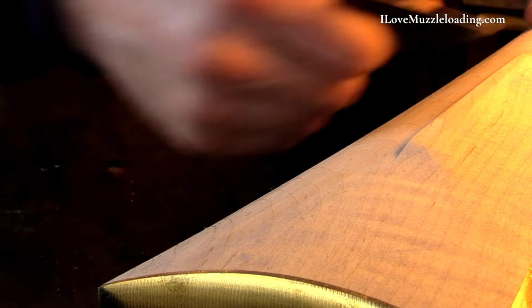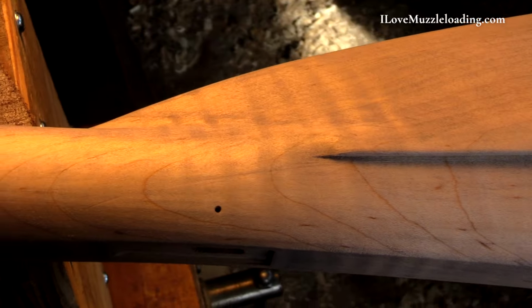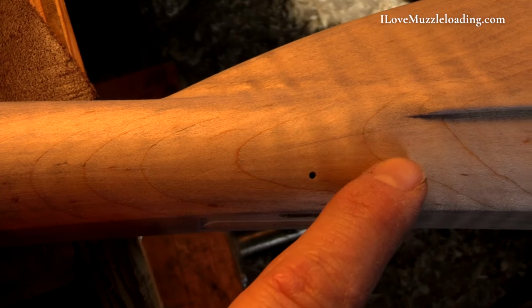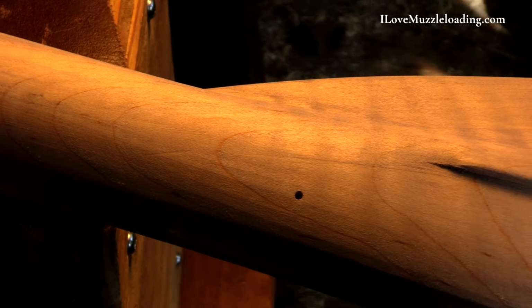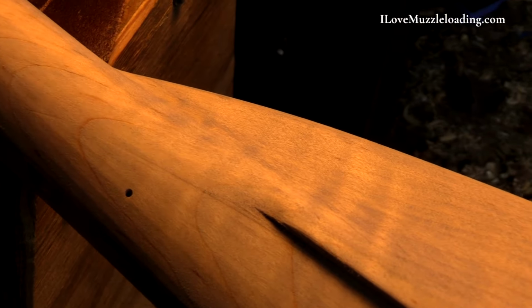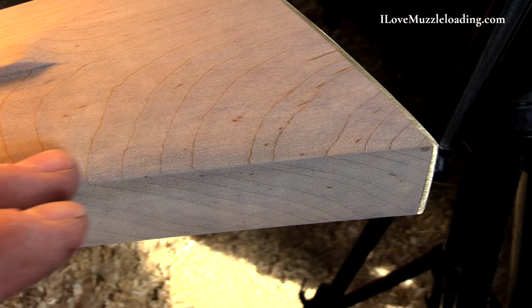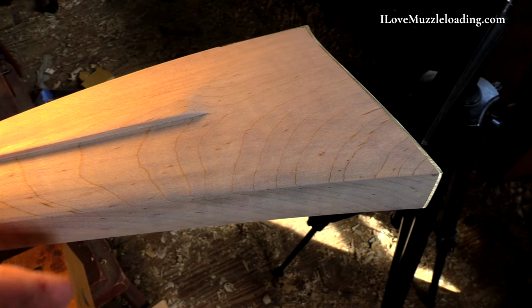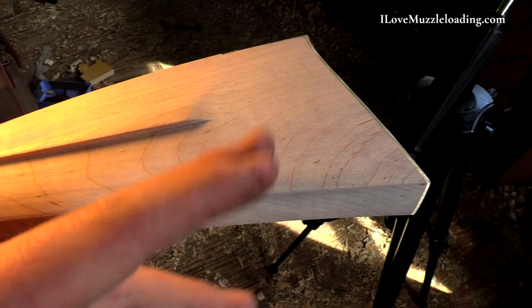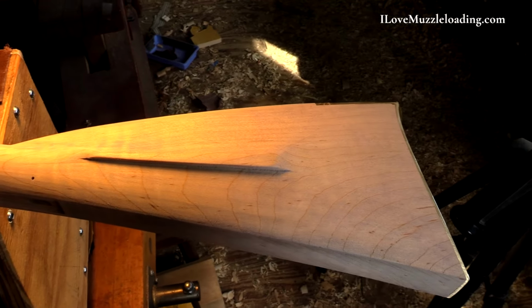I'm not talking a lot while I'm doing this scraping. It takes a lot more focus than sanding does because you're working with the grain rather than just shaving it away. But here you can see a little bit of that effect. So here in this wrist, I've been scraping, and you can see these parallel lines and facets in that stock, in that light. And that's what I'm going for. I'm going for nice, even scrapes down through the stock. Here I've got a little bit of grain difference as we wrap around this toe that I'm working through, but I'm finding if I run into an issue going one direction with the scraper, I can turn the scraper around. So say if I'm pushing the scraper, if I flip it around and pull it towards me, I can cut through whatever issue I'm having. So this is kind of exploratory for me as we continue to work through this area.